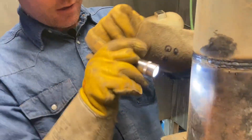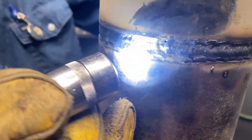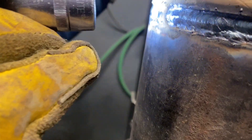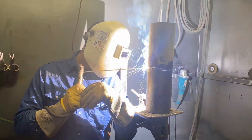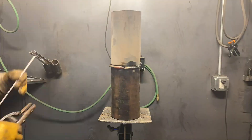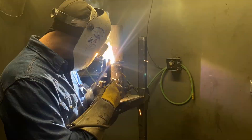That's our fill pass right there — right on top of the hot pass, a two-bead fill. Should be just flush with a little bit of an edge left over, something to follow. I'm going to come across here with a grinder on this bottom edge just to give myself a little bit of a better line to follow for the cap — we want a really nice straight even cap. Notice that top edge is still just a little under flush, which is what we're looking for. There's a four inch Schedule 80 on a 2G — three-bead cap, two-bead fill — turned out pretty nice. That's it for me. If this video was helpful, hit that like and subscribe button, check out our other socials on the link below. We'll see you on the next weld.